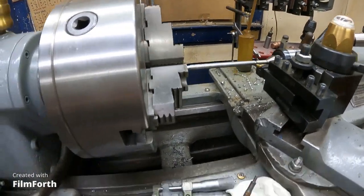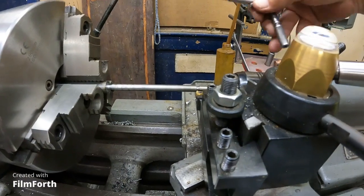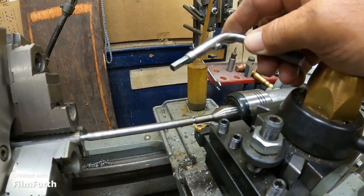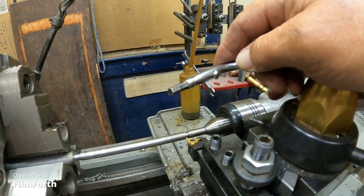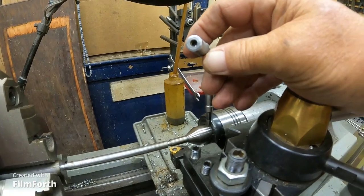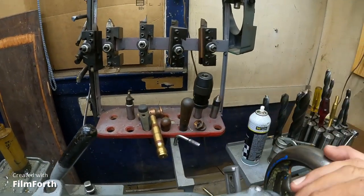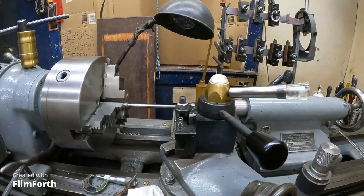Okay, I really wish I had some copper material, but maybe this is good that I gotta call this a piece of practice stock. I made this little wrench here for my tool holders, and I had it in there and it started coming undone. There's actually a set screw there, and so I filled that thing with JB Weld with a syringe and stuck that thing back in there and clamped it down. I'm thinking about maybe a screwdriver on this end, or a hex for taking the inserts out of the holder. But that mounts right here on my tool holder. Kind of handy.